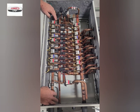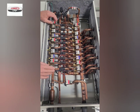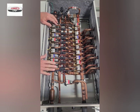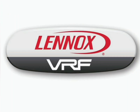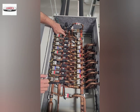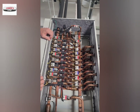The hot gas line is coming in here along the top. If we need to heat, we open up these solenoids. The solenoids will then allow hot gas to go out to the indoor units and liquid refrigerant to come back. Coming back from the indoor units joins the refrigerant coming in from the outdoor unit through the plate heat exchanger, and then can be used for other indoor units in the cooling mode.